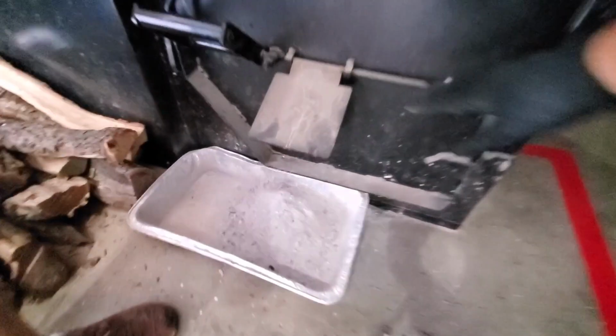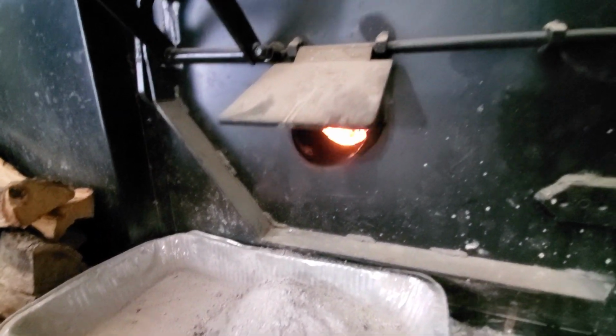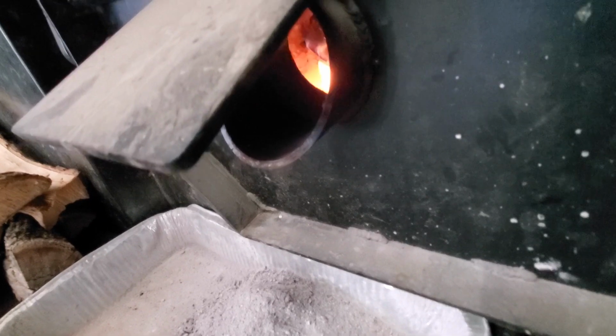Correct. And then this damper, you leave it open, or how does it work? It's on the actuator too. You see how it works? When the damper closes, this closes too. Okay, so this little area here goes up and down, sets up the actuator, comes down here, and this one shuts off the fire damper here. So it's very, very sophisticated, right?